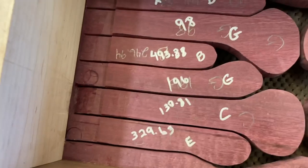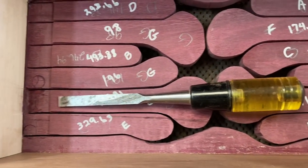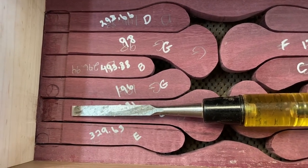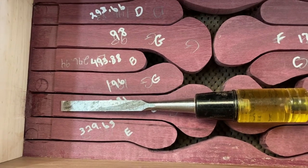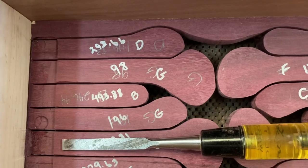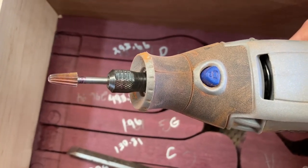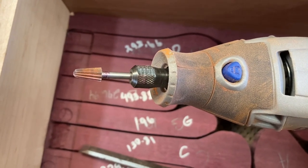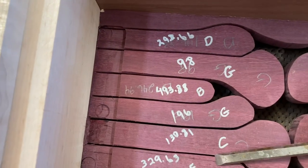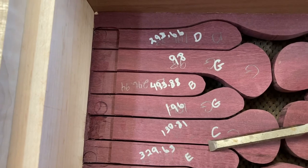These are all my own findings. My preferred method is a three-eighths wood chisel — I keep it really sharp. This purple heart is hard stuff. I've made two out of padauk and while it's a hardwood it's much easier to remove material. I also use a dremel with a bit that's got some angle to it — that's the best bit I could find. It works fairly well and I'll go back in and do a little cleanup. I use it to fine tune just a little bit because I can remove less material at a time with it.